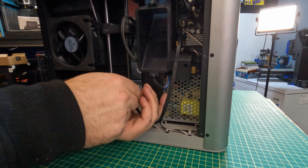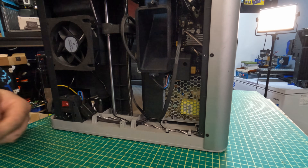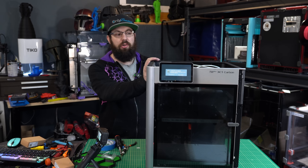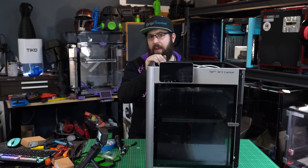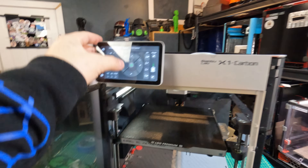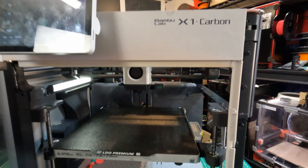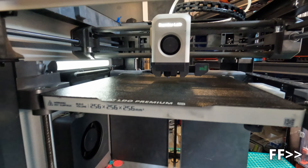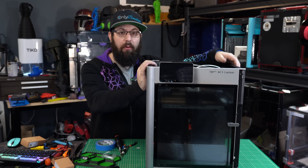Place this annoying cover back on. Be careful — these screws go right into plastic and they're tiny, so it's probably really easy to strip them. Now that we've got the new bed sensor cable installed, let's fire the printer up quick and do a quick test home. Make sure it actually works before we spend the remainder of our life putting all the millions of screws back in so I can put the panels back on. Home all. And we're good. It's working again.